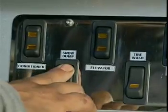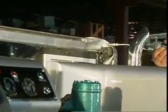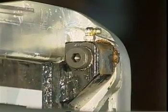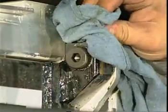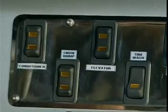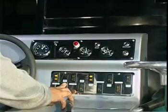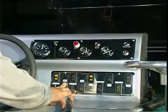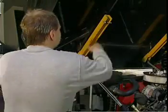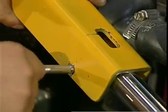Press the snow dump cover button at the top to partially raise the snow bin one foot to expose the bin cover pivot lube points. Lubricate the bin cover pivot on the right-hand side of the Olympia, then on the driver's side. Push the snow dump control button to raise the snow bin until fully opened. Engage the safety bars on each side, remembering to put in the safety pin, and make sure you don't drop the safety bar on the cylinder shaft.